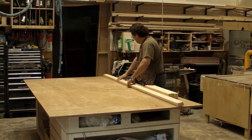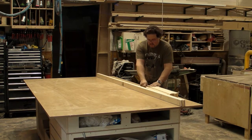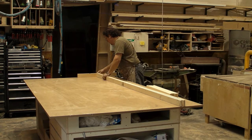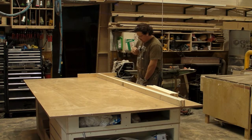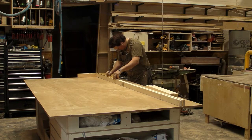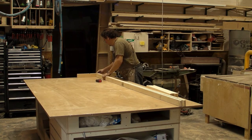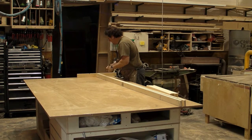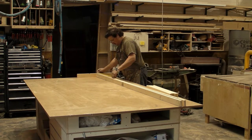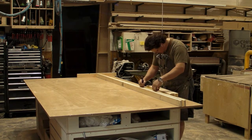Putting together a flat, I do have a video or a series of videos, I'm not sure, a number of times on my channel where I show how to build a flat. What I call a TV flat up here is different than a Hollywood flat. There's an extra vertical on the flat, dadoed into the toggles. It's a better flat in terms of flatness of luan. It just typically doesn't matter in my world, but fair play to them. It is one more structural and flatter flat.